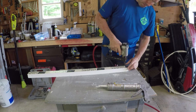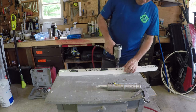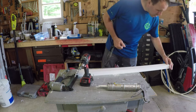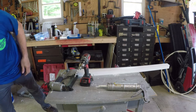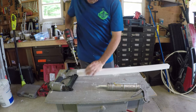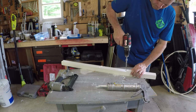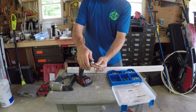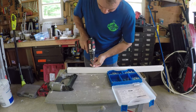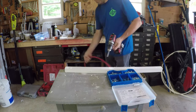This extra fastening is probably unnecessary — you probably don't need as many nails as I put in. Simple caulking and some screws is probably sufficient, but with the expansion of PVC I thought why not put some brads in there and screw it together. The screws and brads will go underneath so they're not on top of the sill, so none of this is facing any weather and there's no water sitting anywhere.